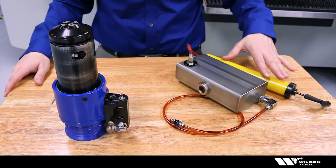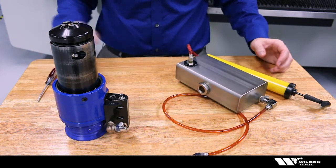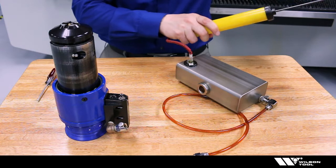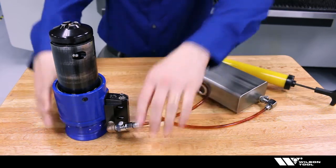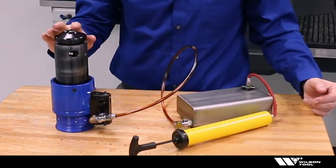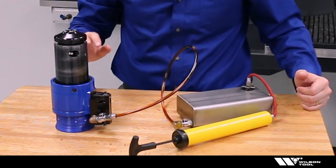Finally, we'll talk about priming the pump. You'll need the air pump that came with it, the tank, the quick connect hoses, the tool itself, and something to press down on the actuator. After you fill the tank with oil, put on the included air pump and add some pressure into the system. Attach your quick connect to the tool and start priming until oil comes out the top. Once you've confirmed oil has come out of the oil mist nozzle assembly, remove the pump end from the tank and put the original end back. The tool will remain pressurized.